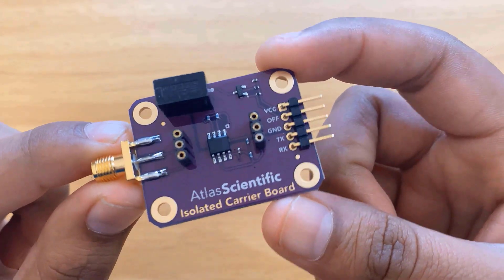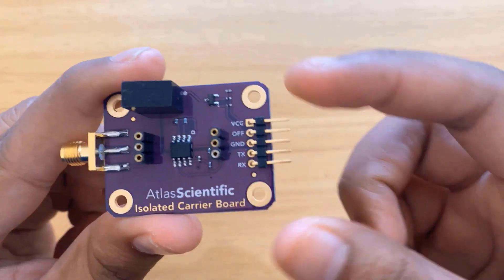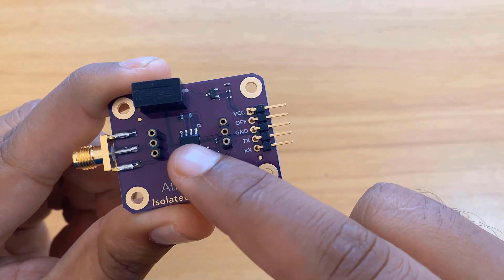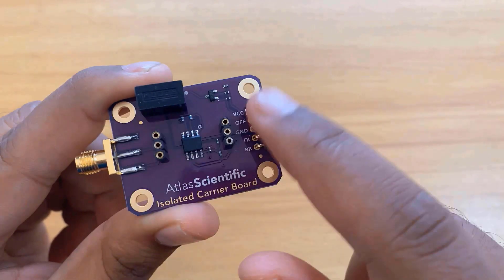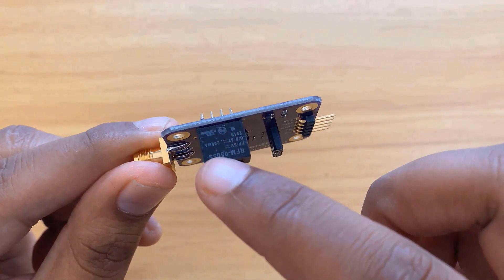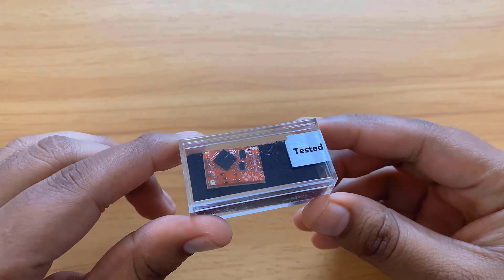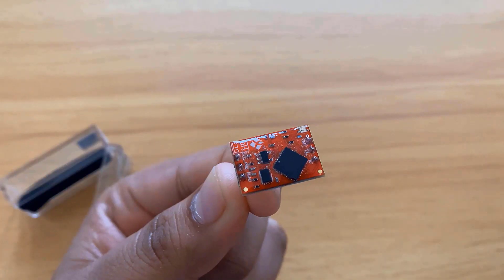This integrated circuit emphasizes low jitter and low phase noise to maximize data converter performance. There are 6-pin headers for connecting another integrated circuit, and 5 header pins for power and UART interface. To read the data, you can use the TX and RX pins. This is an amplifier module for current conversion, and at the back, the TX and RX pins are converted to SDA and SCL. This board is also part of the signal connector board.